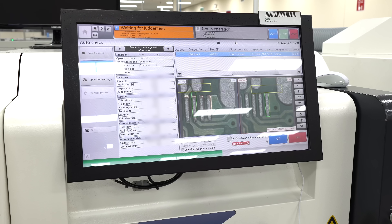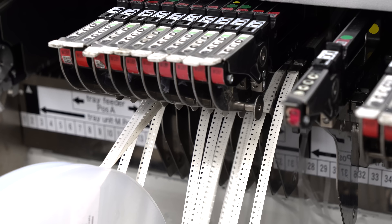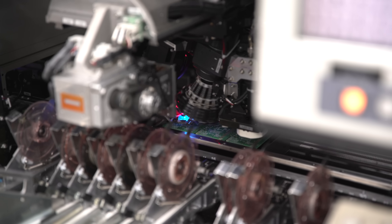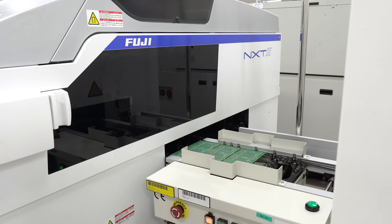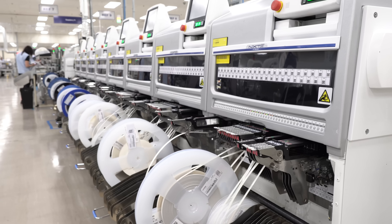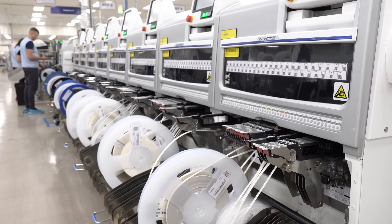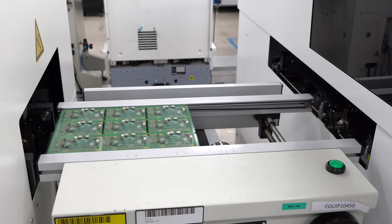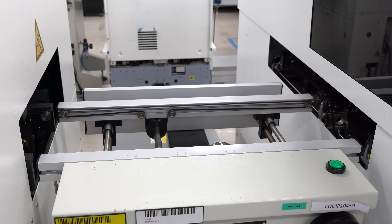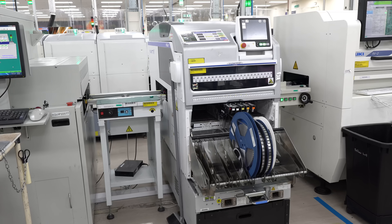It's very unique how the individual components are applied — it's like building a city. We start with the very small houses, or the very small components, and then build up to the larger ones. The heads on the pick-and-place machine, that Gatling gun-like thing that spits circuits onto the solder paste, uses a tiny puff of air to jam the components into the paste. The head has to get really close to the board, like a millimeter or two.